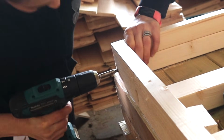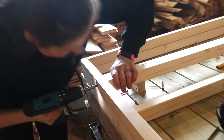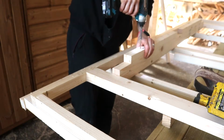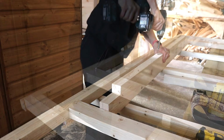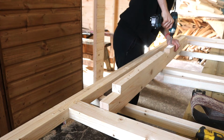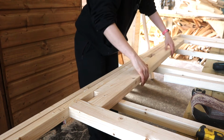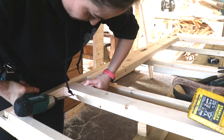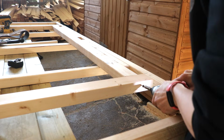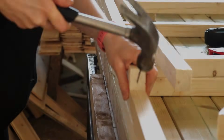This then meant I needed to make the side panels just a little bit wider than the shortest edge of the base. Then I screwed some timber between the door hinge spars at the top, which I'll also add some stop lats to later, but I also added an extra piece if I ever wanted to screw guttering there with the roof falling towards the front. And that's a front and back frame done. And it's time to work on the two smaller sloping side panels.